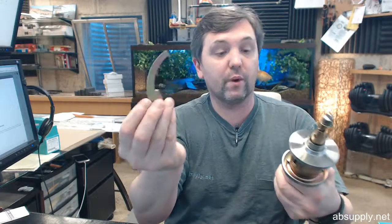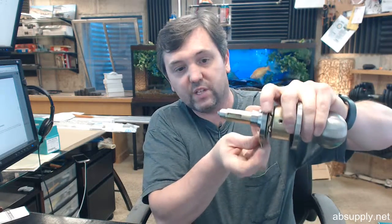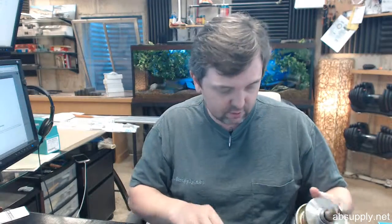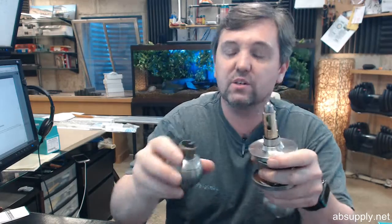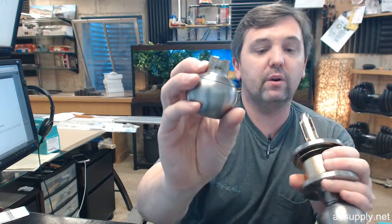You'll use your spanner wrench here, a little dimple that's there. Put your spanner wrench in and rotate that to make it tighter than you can with your hands. And of course, when you inspect the knob, you'll see that the tab is there and it's really in no other place. You're going to want to run the slot down in the same area of where that tab is going to be. Pushing it on, if it's straight, it will literally push the tab down and it will pop back out. You're going to want to test that to make sure that it's engaged properly. And that's it.